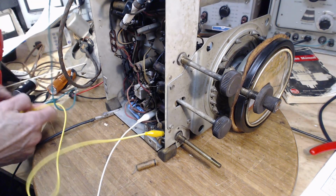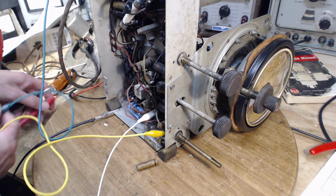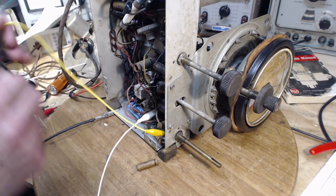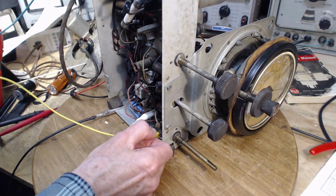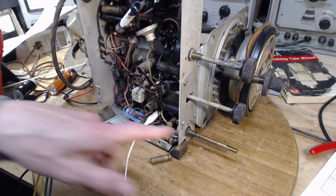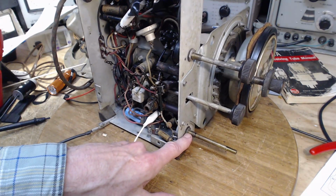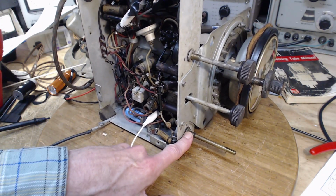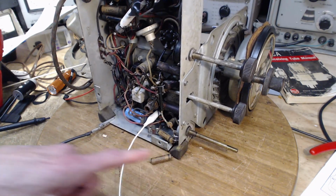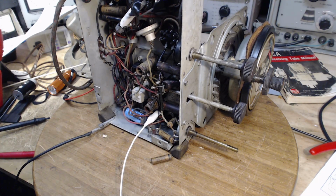Okay, so something I've never seen before. Seems surprising to me they would make a volume control that way. Although in an awful lot of radios, one side of the volume control is grounded to the chassis, just like this one. But it reduces the flexibility of this part. If you're a company building this part and offering it for sale, there's a lot of radios it couldn't go into because of the fixed ground inside it.